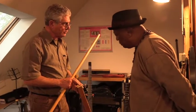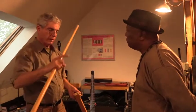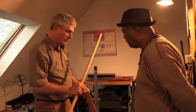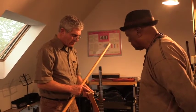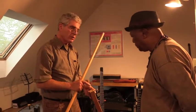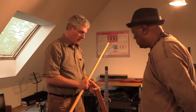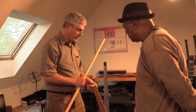A magnetic pickup has a very pronounced midrange, which parallels acoustic instruments, and you can just plug it in and get your sound. But you noticed I was turning down the treble there, because this thing has so much treble compared to a magnetic pickup, but it also has so much bass. This thing will track flat down to one or two cycles. It's really quite an unbelievable technology.